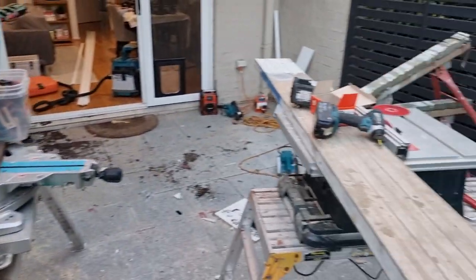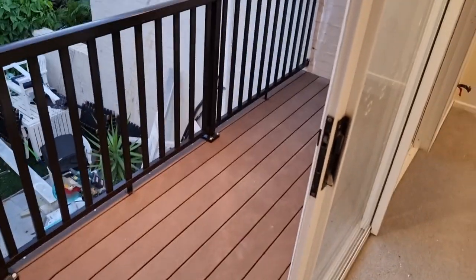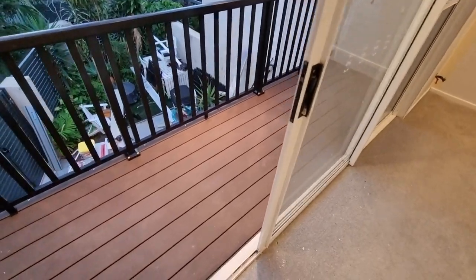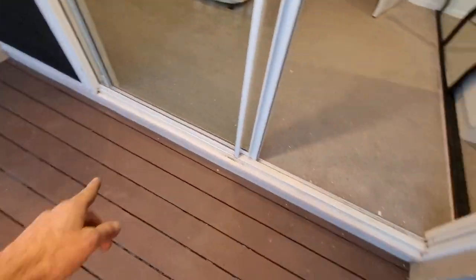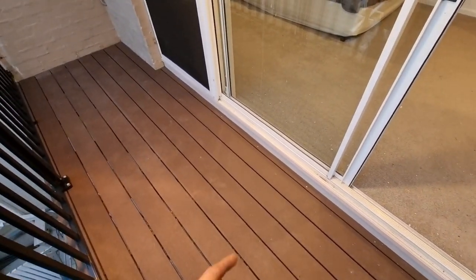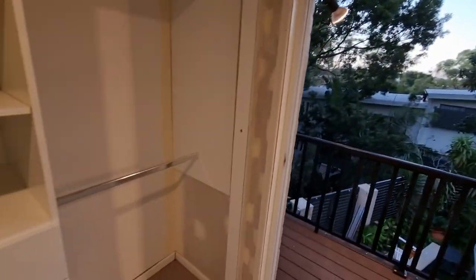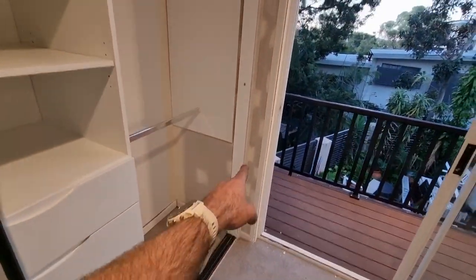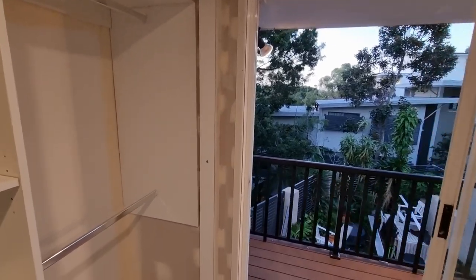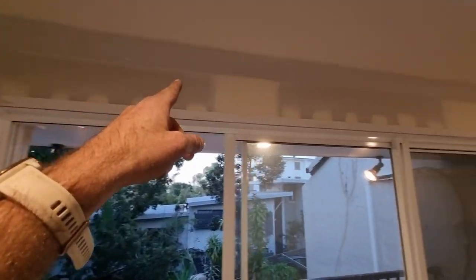Just going to run around now and begin the pack up and a bit of a clean up. And why I did all this work was because originally I was just going to do the deck and replace it, because that deck had a lot of wet rot. Then I opened up the wall down there where my joist was sitting on and found out that termites had eaten all downstairs. I did a couple of inspection holes here, took off that architrave, and found that termites were all through here — termites ate all up there.